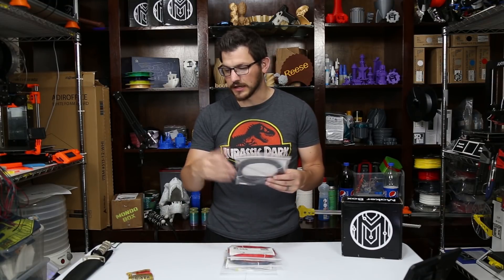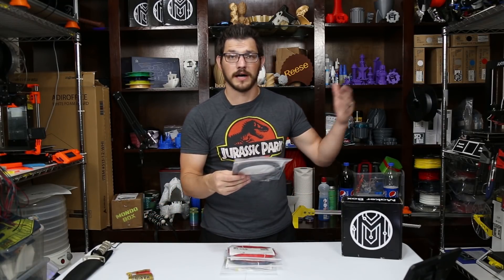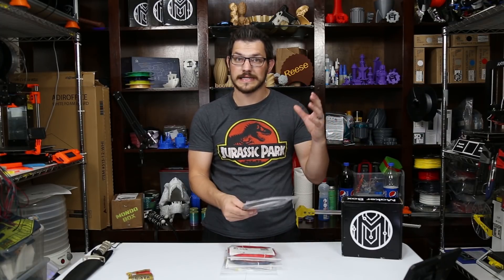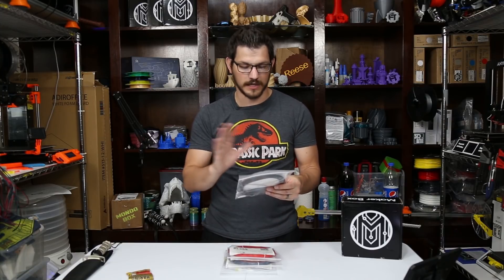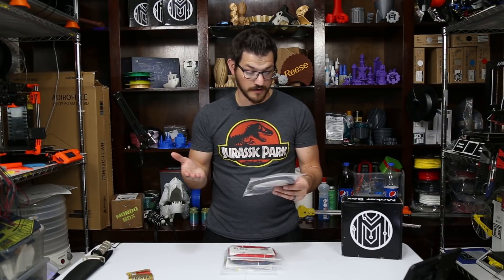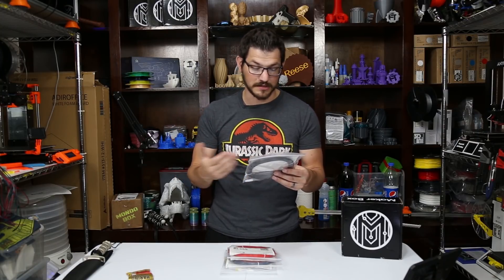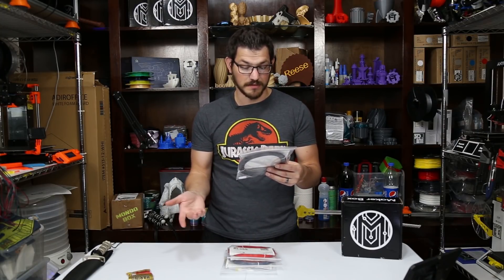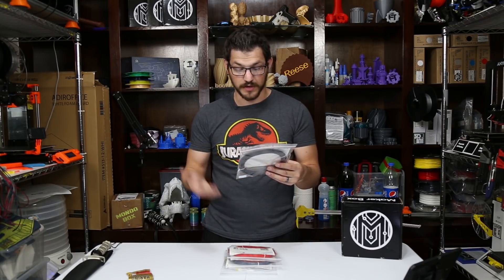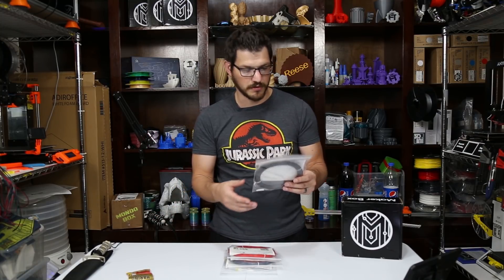Because they included this abrasive filament, I kind of wish they would have gotten a coupon from Micro Swiss, which they've gotten in the past. Luckily my CR10S is outfitted with an all-metal Micro Swiss hot end and a Micro Swiss hardened nozzle, so this will print on there without a problem. It's US-made PETG filament blended with chopped carbon fiber — stronger than ABS and PLA, with more heat resistance than PLA, and it's more stiff and UV resistant. Should be fun to print with.